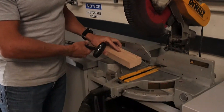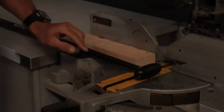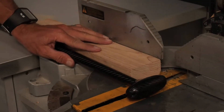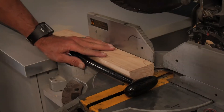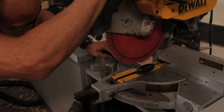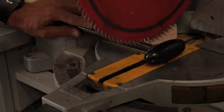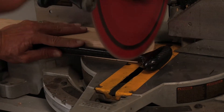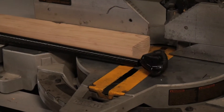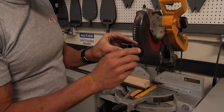The first thing to do is grab a piece of 2x4 or any piece of material stock about this size to stand your handle away from the fence, because you don't want it to pinch or catch. Set it up like this, then bring your blade down so you know exactly where you're going to cut. You can see I'm going to cut it just below the handle. Be very careful. Now you have your handle with a bit of the shaft left in it.